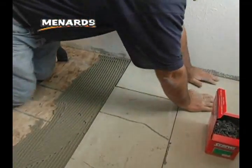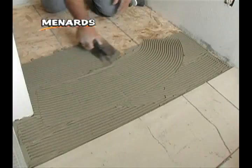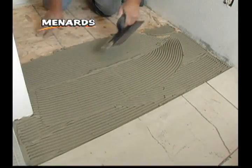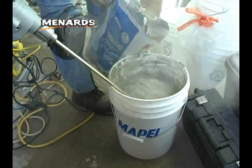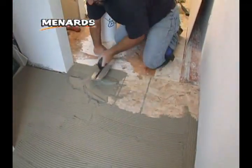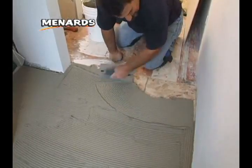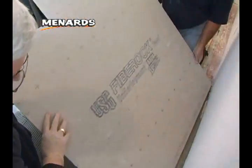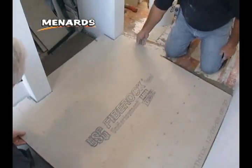In order to create a more stable surface and prevent your underlayment from flexing, which causes tiles and grout to crack, apply a layer of thin-set mortar to the subfloor. A professional-grade dry-set mortar like CuraSet by Mapei is a great choice for this step. Mix the mortar according to the directions and spread it on the floor using a notched trowel. It should be combed so all trowel lines are going the same direction. This will allow the mortar to spread into any voids created when the underlayment is secured to the subfloor.